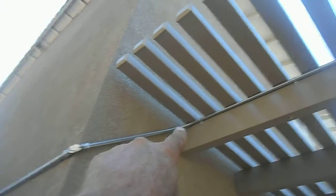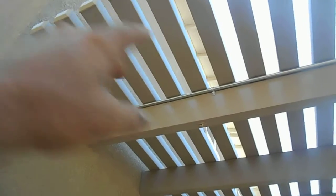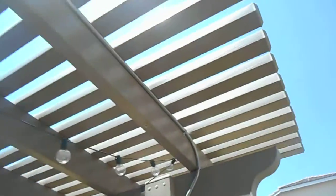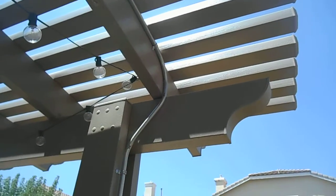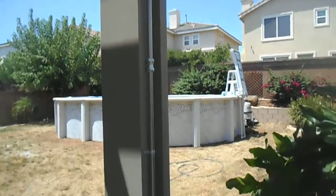I didn't angle up because I wanted to get it up underneath the bottom of that eave, underneath the top part of this lattice coming across here. I took it up with a 90-degree bend, brought it over, then came down and had to go around that 2x6 with almost a big knockout bend so I could bring it down this post.